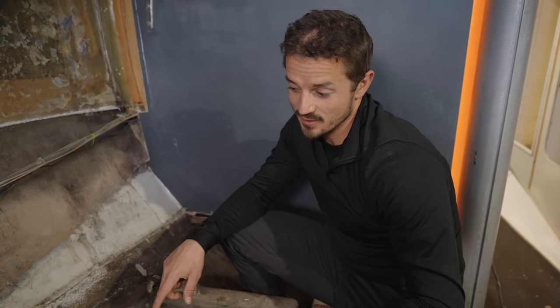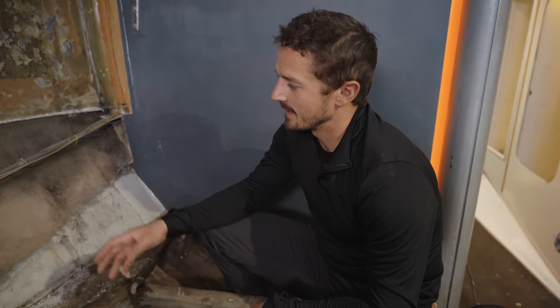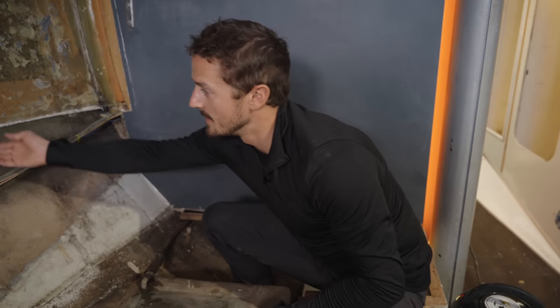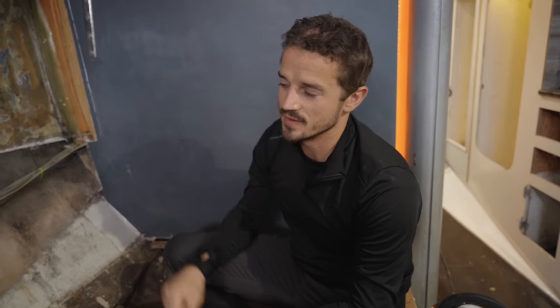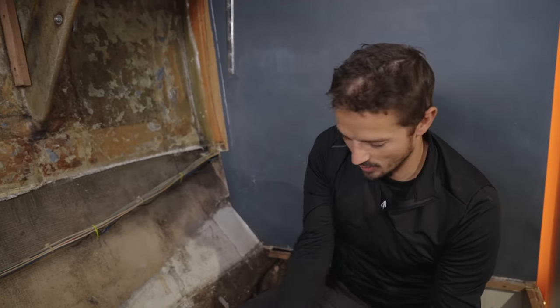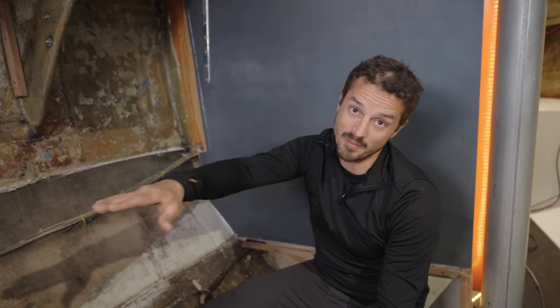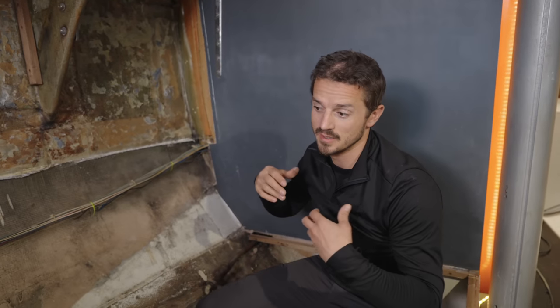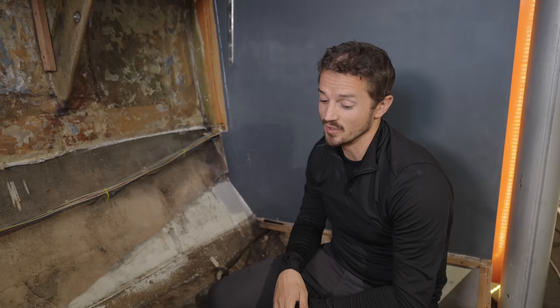One of the reasons why I ripped the whole nook out was to replace these water tanks, but also to reinforce this whole section of hull. The things we've cut out so far aren't structural members — the plywood and the pilot berth were only held in by one layer of fiberglass on one side. While everything's out, we're going to reinforce these knees by bringing them all the way down, connecting them to the bilge on each side, re-glassing these bulkheads to make them stronger, and getting rid of these water tanks.